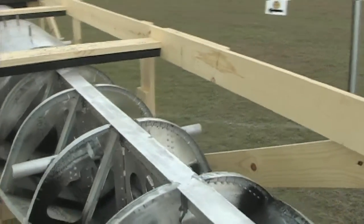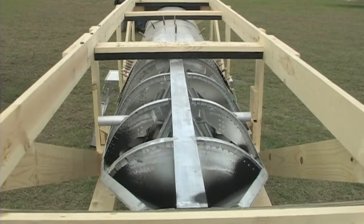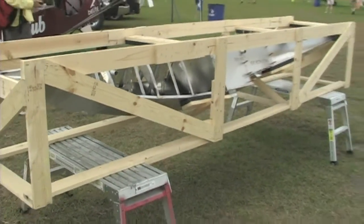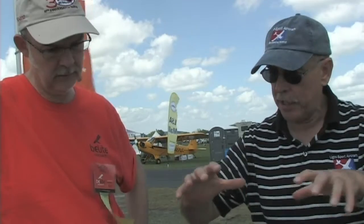There are guys flying experimentals that are a little heavier — a 350-pound airplane with a single pilot and fuel — who'd want this kind of float. An Air Bike customer already bought a set. Are you planning a bigger one? Yes. There's a sweet spot around 1,000 pounds gross weight — for something like an original Kit Fox — and the next sweet spot is 1,430 pounds for LSA. That middle number covers what we used to call ultralights or what Europe calls microlights. This is also an item that can be retrofitted to an existing airplane.